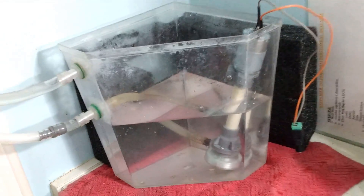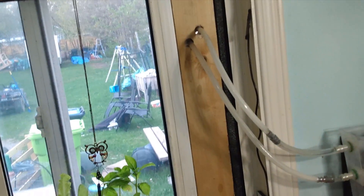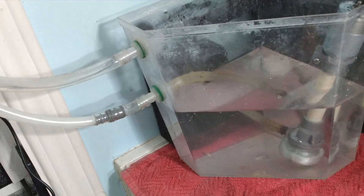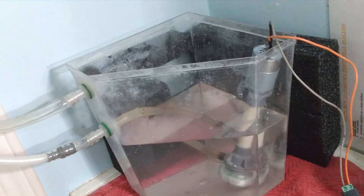I have the centrifugal pump installed and about ready to go. I'll fire that up — hopefully it works and is a little quieter. The centrifugal pump doesn't quite have the same pressure or flow as the other pump. For this application it works, but if I add more water blocks or cooler units to the system, this could be an issue. I may try to make the gear pump quieter somehow.